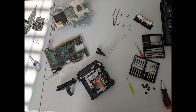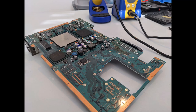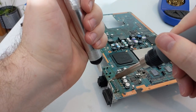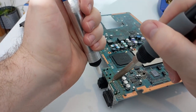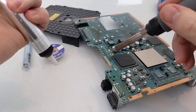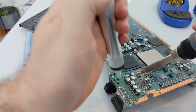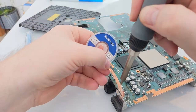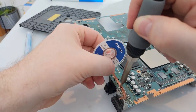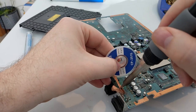I decided to cut out a bit more of me struggling. Here's an aftermath shot of everything just thrown all around. A general dusting of the parts with compressed air to remove the dust. What surprised me was there wasn't really any thermal paste on the GPU or the CPU — just a magnetic rubber-ish type laying over everything. Because the guy had thought there was a display issue, I was going to reflow the solder on a couple of points where the video cable plugs into the board.